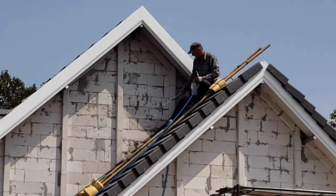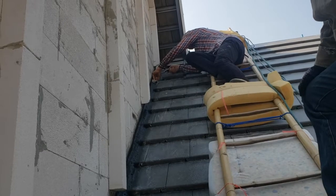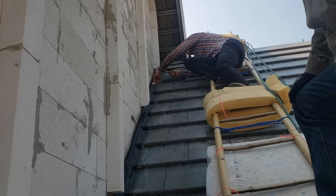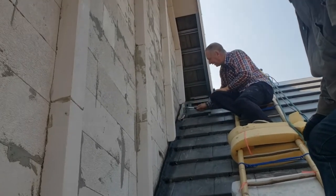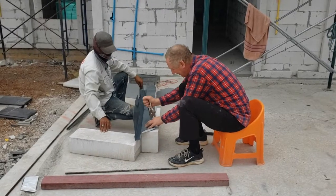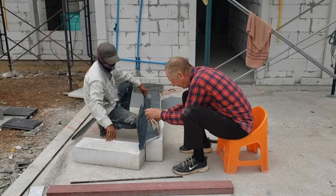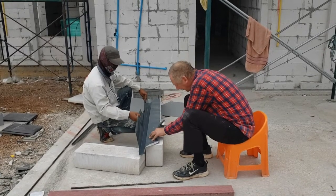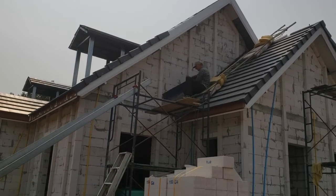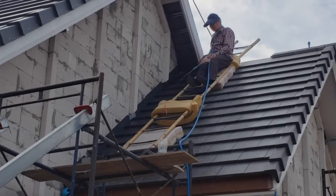At the so-called abutment, where roof tiles meet a vertical wall, we used the Thai method to seal it, which of course did not work. So we did what we should have done in the first place: make place for a real abutment gutter. And then of course build one from scratch, because no one has ever heard of this. A few days later, not a drop gets in.